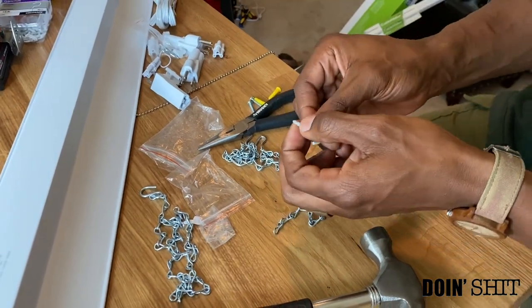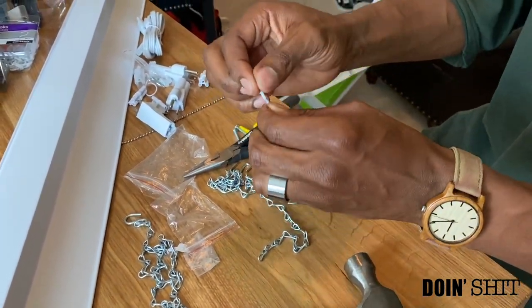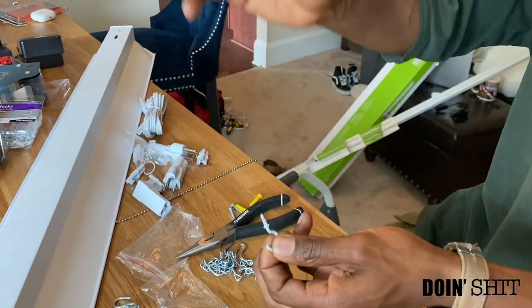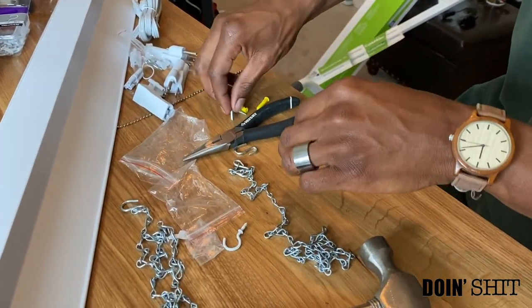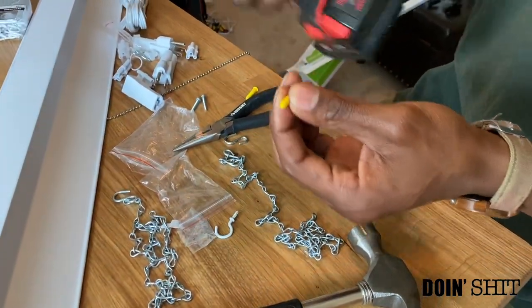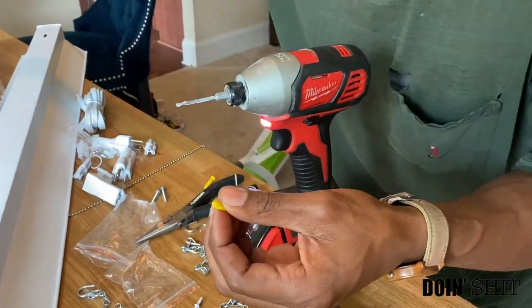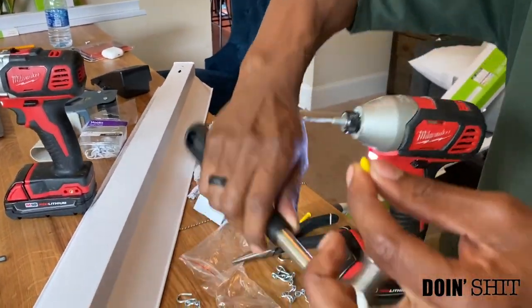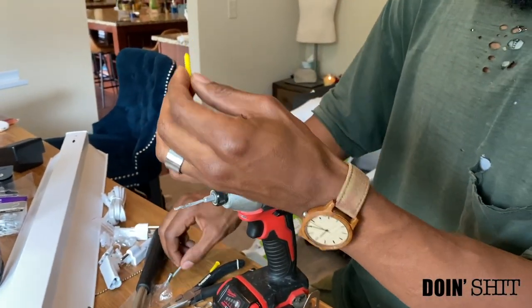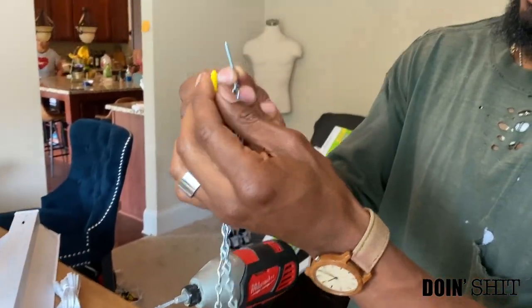I did all the measurements and got the alignments and placements for the screws where I want the lights to hang. Now I'm going to show you how I'm setting this up. Like I said, I was using the small drywall hooks originally, but they came out and fell on the table and damaged my lights — luckily I can still use them. Now I'm using the drywall anchors. I'll use my drill to open the hole up, then take my hammer and knock the anchor into the ceiling, and then run the chain through it and screw it together.